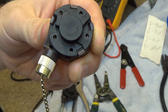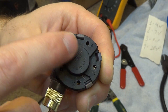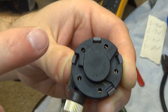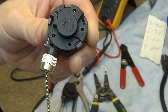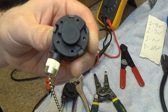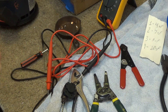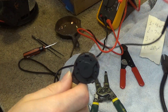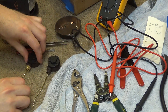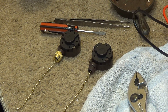That's not what it does. In reality, for position number 1 it's line to 1; for position number 2 it's line to 2 and line to 3 and line to 4; for position number 3 it's line to 3 and line to 4; and for position number 4 it's line to 4. So what was happening was I had connected this up to my capacitors and got low speed correctly and high speed correctly, but speeds 2 and 3 were also high because, as it turns out, the connections are all cumulative. I did extensive research on these switches and could not find one that worked the way I wanted, so I modified the switch to work the way I needed it to.